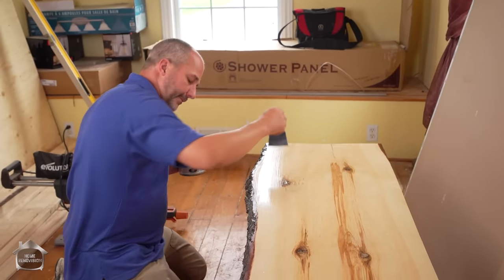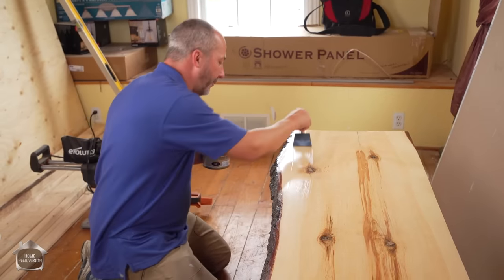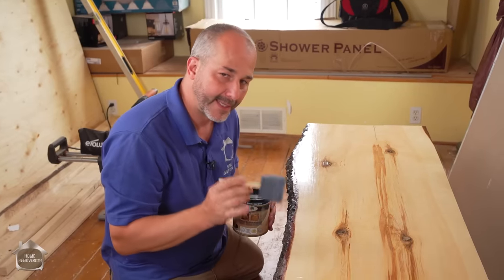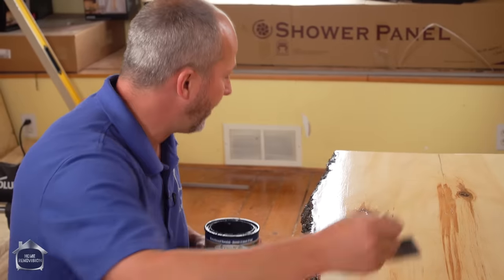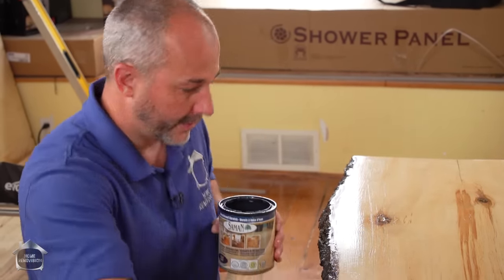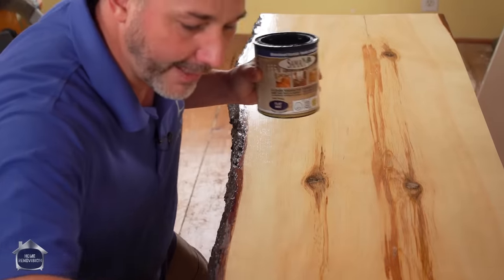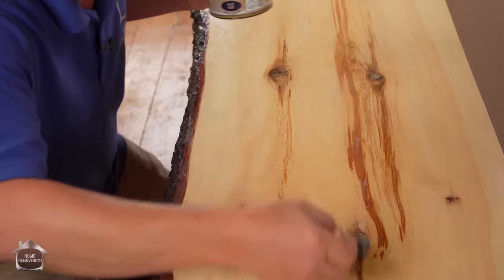And you can use it to sand the finish of a gloss like this on a floor or a piece of furniture. Oh, here we go. And what it does is it sands it so fine you can't even see the marks when you're done. And that's why you want to use it. Because you can take something like a 4 or 5-0 on a finish coat on something like this, and it'll just become smooth as glass. There's no such thing as applying a finish smooth as glass. You actually have to sand it to be smooth as glass.